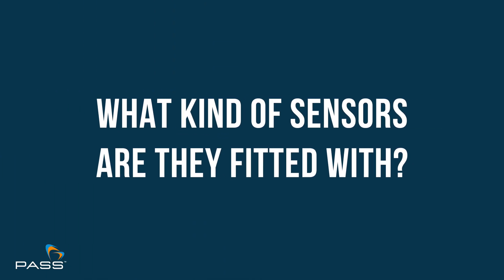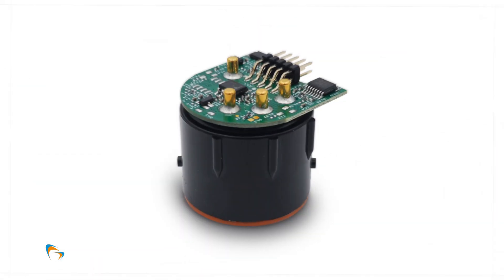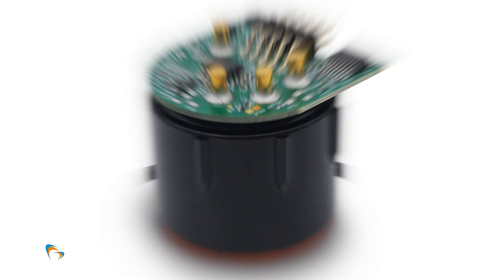Concerning the sensors, the flue gas analysers are fitted with an O2 sensor and a CO sensor, both of which are measured sensors. CO2 is calculated from those measuring sensors. They can also be fitted with a total NOx sensor. With the 130, you have the O2 sensor, CO sensor, and calculated CO2, plus room for a third sensor — either low NOx or total NOx — but you can only have a maximum of three sensors. It's not possible to have both low NOx and total NOx simultaneously.